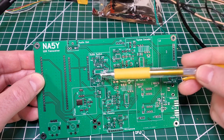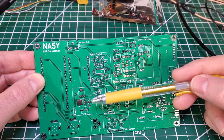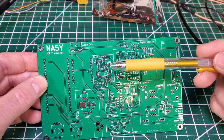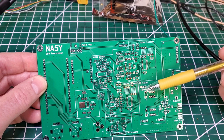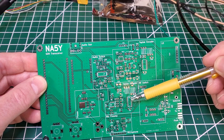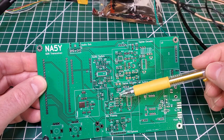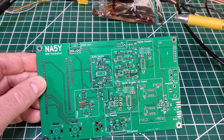I don't want to go through all that again, but I will come back and show progress as I build up portions of the board. What I hope to get to in this video is putting the Tayloe detector on. I won't do the RF switch this time — just the Tayloe detector, inject an RF signal, get the SI5351 on, bypass the audio switch, and confirm I'm not getting those strange artifacts with this board.